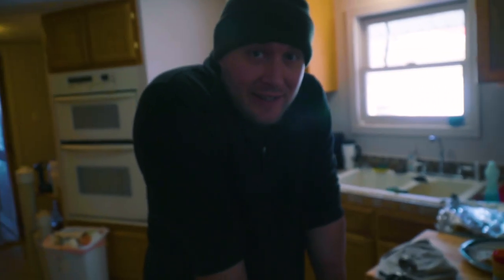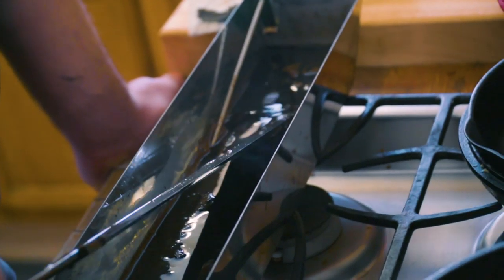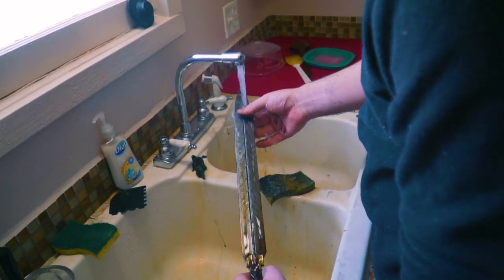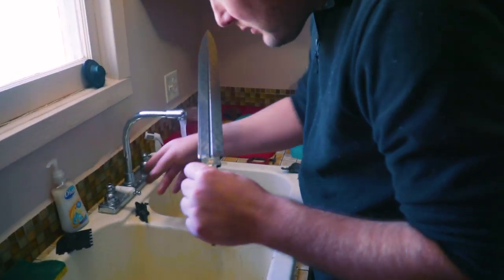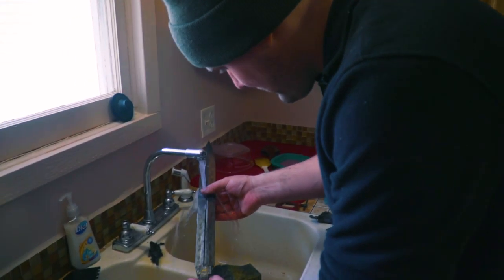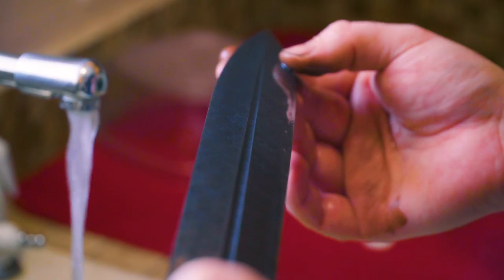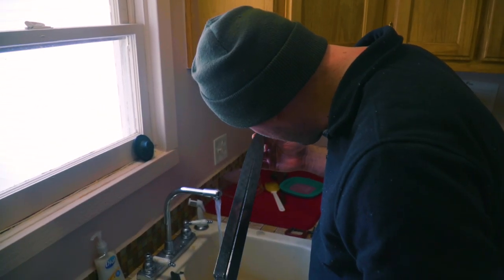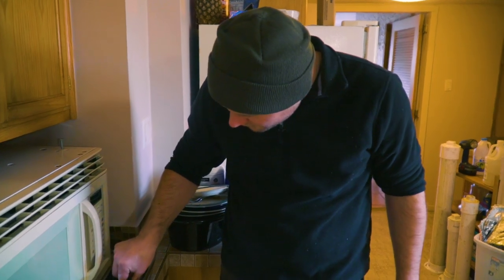I am trying to coffee-darken this dagger now. So far it's coming out kind of yellow, and I'm not sure how evenly it's darkening, but it's early on in the process — it might need to cool down a little bit more, since lower temperature seems to really help if it's turning too yellow. I etched the tang pretty quick and you can already see the pattern on the tang. I'm finally not getting that yellow — a little lower temperature now. I'm gonna put it back in there a bit longer. For future reference, you might want to start doing this with about 100-degree coffee — that's where it started not leaving yellow on the blade.